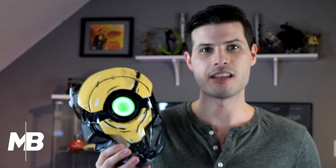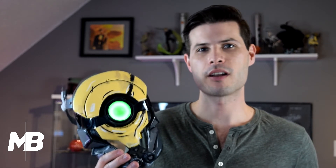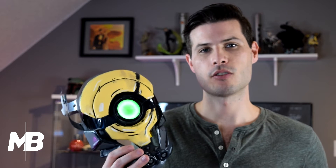The lights inside are a NeoPixel ring, which I wanted to use because each LED is individually addressable and allows them to blink — which you'll see throughout the video, just like that. This 3D model was actually created with a physical lever inside to allow for physical blinking, but I didn't feel like that solution was going to work well for me, so I decided to go with the lights blinking in software instead.